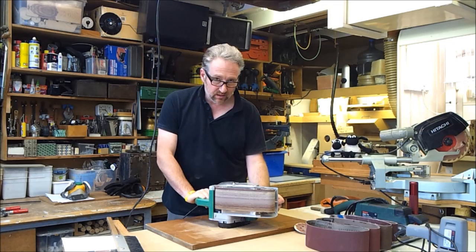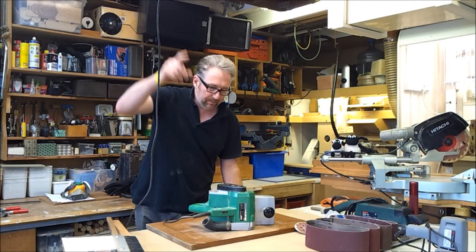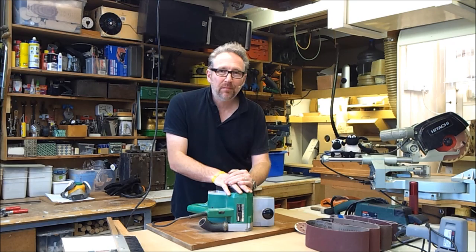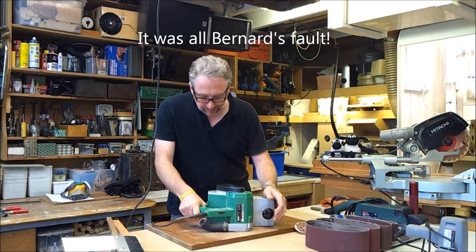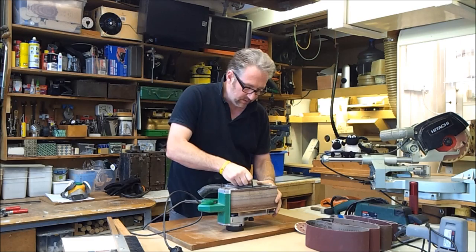So when you're dealing with a belt sander, whenever you're doing anything with a belt sander, put it on its side — either this side or that side, it's fine. Then if it is accidentally plugged in, it's not going to fly off the table. Believe me, that weighs about two and a half kilograms and will fly right off the table — I've actually seen it happen. A sander was borrowed and all three of us saw it fly off the table when plugged in and bounce off a concrete floor, never to recover. These things are very aggressive — if you're doing any work on it, you unplug it, always.